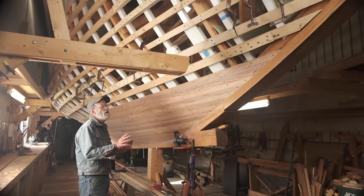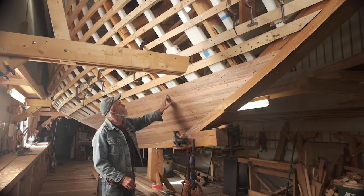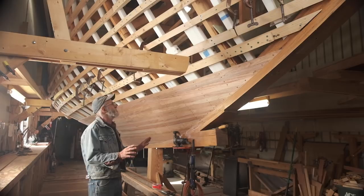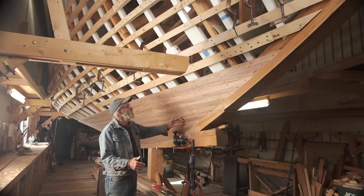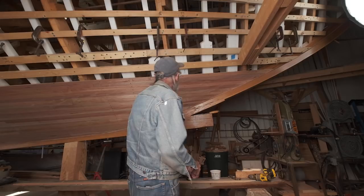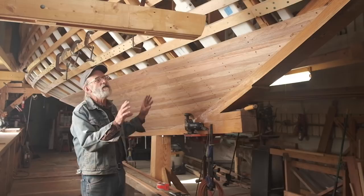It's not unlike other strip planking. It's not fastened to each other — it's only glued to each other, so we didn't nail it or edge nail it to each other, and there's really no need to with this glue. It just holds it in place fantastic. It's got a lot of framing in this boat. If this were the only layer of planking this boat ever saw, it would be substantial enough, but we're going to put another layer of planking right over it. That's going to be Carvel planking and this whole system is just a little bit different.